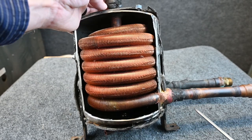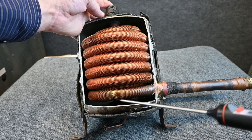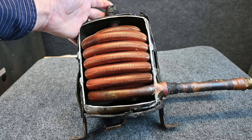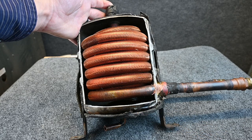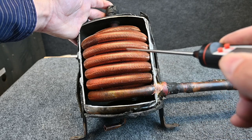So we are essentially taking heat out of the fluid that's inside these tubes and moving it to the refrigerant that's on the outside of these tubes, but the inside of this shell. So the refrigerant is boiling, changing state from liquid to vapor. They also add all these little ridges on here to help transfer heat a lot faster.